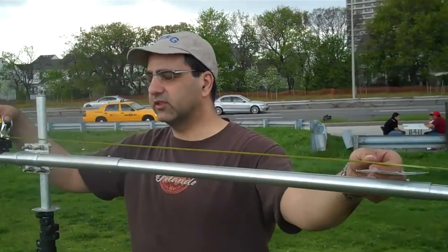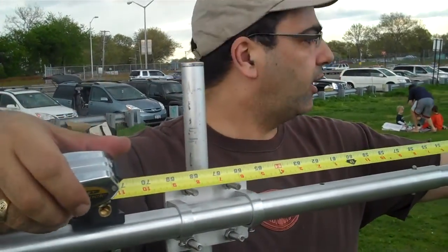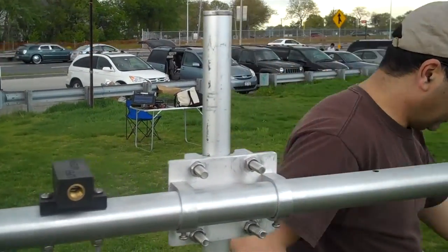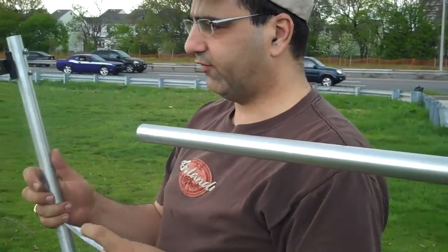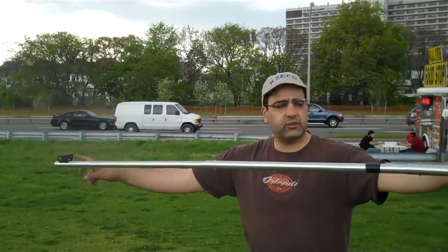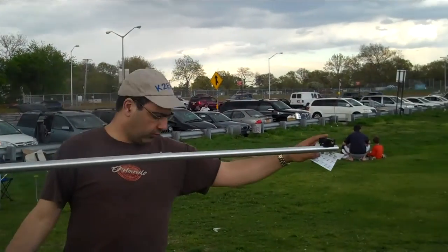You can see that the director, here where my hand is, is 71 inches from the end of the reflector, which is the element over there. We're going to add another director element to the front of the antenna, which will be at a distance of 64 and a half inches — just a single hole from here. So now we have the antenna ready to be put. There's 64 and a half inches from the driven element to the director and 71 inches from the driven element to the reflector.